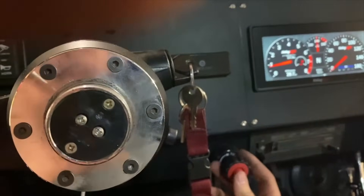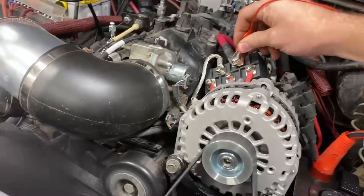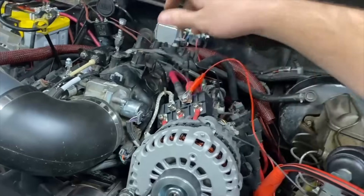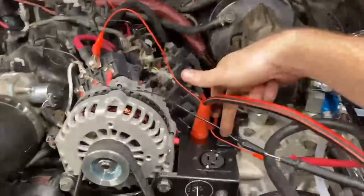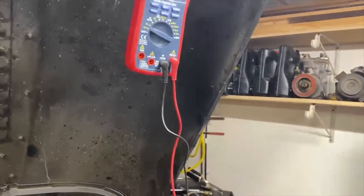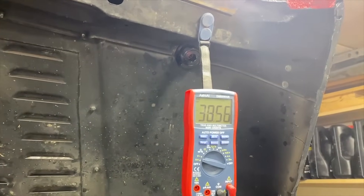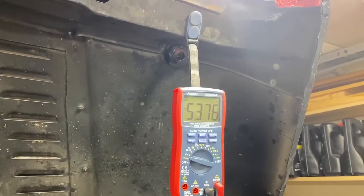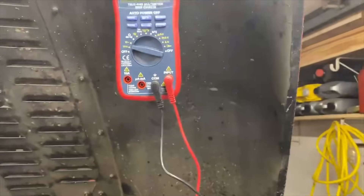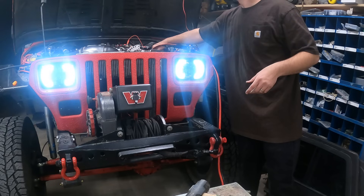Let's go see what our voltage is doing on our multimeter. At idle - remember it's not charging right now because I have the button off. At idle for weld mode we're making 30 volts. I'm just going to use my hand on the throttle to see what happens - giving a little bit of gas, we're already up to 40. We're climbing: 50, 60. I'm going to put it at about 1500 RPMs for this weld - we're at about 40 volts.